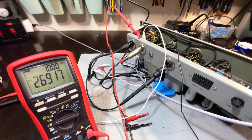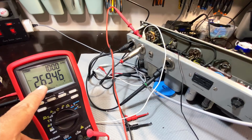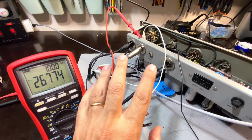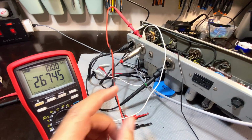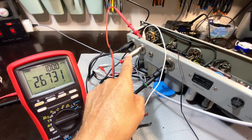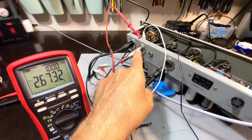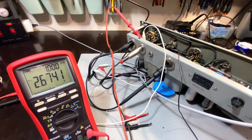Okay, so before I start trying to plot that, in other words, before I alter the frequency and see what response I get, I want to know what the output impedance of this is. I want to know what impedance it's expecting, and I don't know what the input impedance is of the transport. So when you are sending the signal from here to the recorder, it sees an input impedance, and I'm not sure whether that's 600 ohms or whatever, because remember, 600 ohm output from the secondary of the transformer is going through that thing there. That's the filter. And it then goes off and goes into the recorder itself. But I don't know what the output impedance is, and I don't know whether it will affect the response much if it's unloaded.